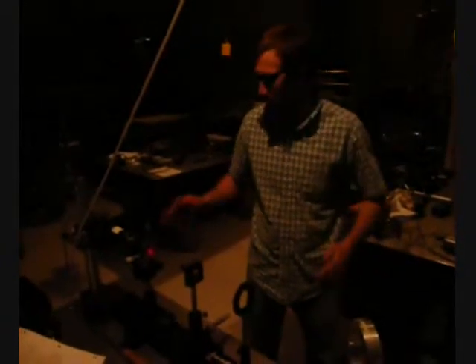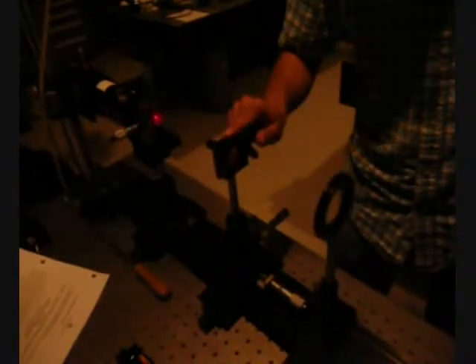I'm going to show you our initial setup for the lab today. Basically all we're trying to do is get a collimated beam to go through the shear plate so we can view the fringes on the screen like Alex talked about before. We have our standard helium-neon laser, a spatial filter to clean the beam, a 200 millimeter focal length singlet which is collimating the beam, and the non-wedged shear plate is right here.